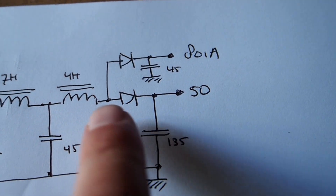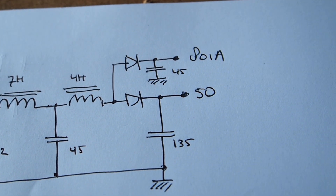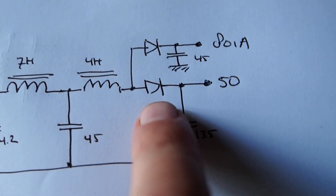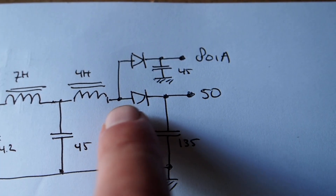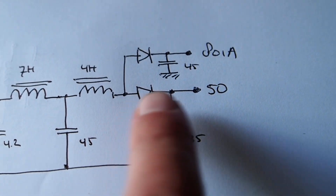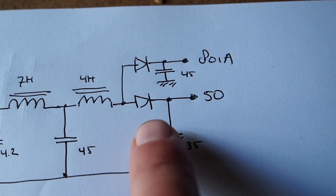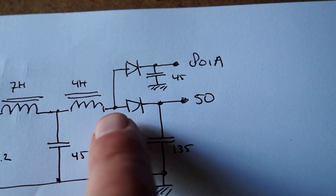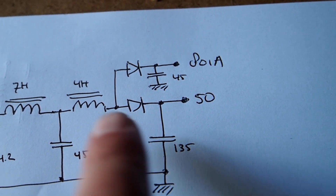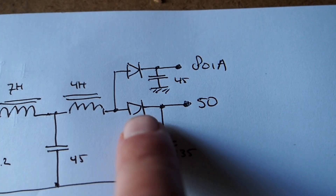I'm using a high-quality Schottky diode here - it's only a 100-volt diode, usually used for 5-volt circuits. If you have a very good DAC or something, you often use those diodes. The diode here of course never switches off, so unlike a rectifier where there is this switching behavior - even if you bypass it with a tube rectifier, you can sort of hear that there is, as real tube people would say, sand in the circuit. But this silicon, because it never switches and is under more or less constant current, you can't tell that it's actually in the circuit. The sonic influence of adding these diodes I couldn't detect.